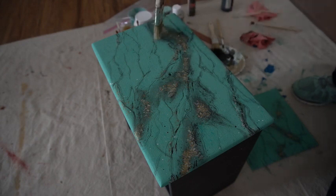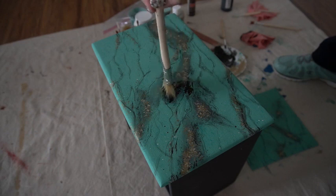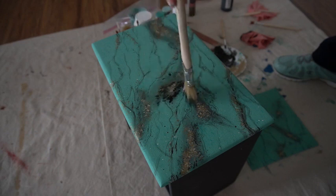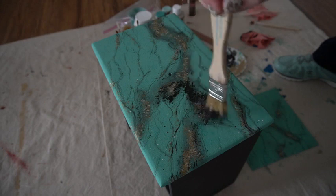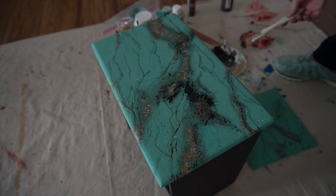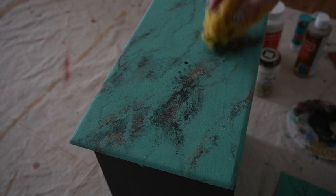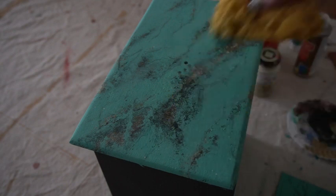Since this is a multi-layered finish, I didn't stop at just one coat of those three shades. I came back in with black to break up some heavier areas of white and gold, and to add back in some much darker black areas. I ended up going back and forth between black and gold several times until it felt right. The final step was to use the damp sea sponge with some of my mid-tone to further break up the heavy blotchy look. The sponge was a bit more than damp but not dripping. I tapped very lightly and extremely randomly, then let the piece cure overnight.